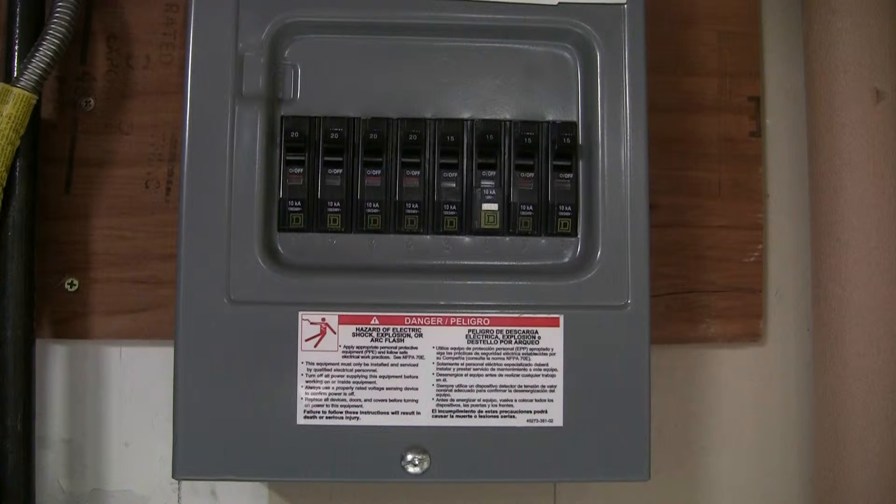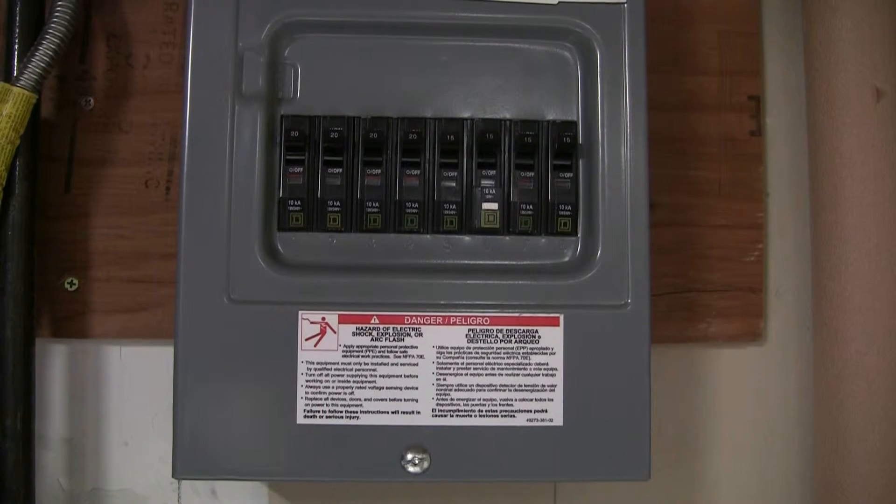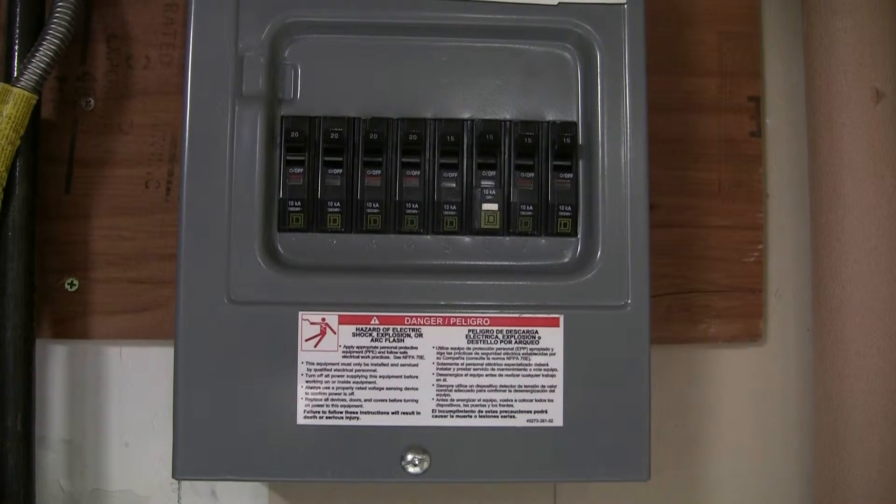So technically there are three kitchen circuits, which is fine. It's also tied to the bathroom circuits. According to my electrician friend, that should be two 20-amp circuits. If you have separate bathrooms, you should have them. I think code is one dedicated 20, but don't quote me on that. He says usually when he does a new house he'll ask the owner if they want them separated and nine times out of ten they say yes. If I ever could rewire it I would do dedicated runs, but I've already patched the ceiling so it's a little late for that.